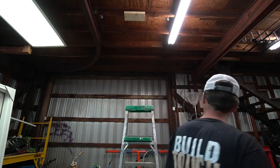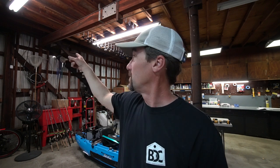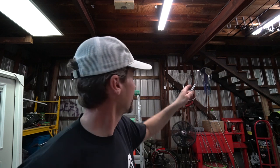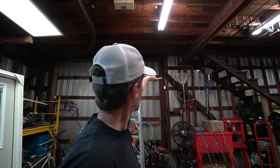This gang reel pulley has to be mounted in the center between the two front mounting points, and it needs to drop down an inch and a half according to the directions, so I cut a block of wood to add up there. One difference is they want you to pre-drill the holes for the lag bolts with a 5/32nds bit. Next I need to prepare the anchor point on the wall where the rope will run to — another eye bolt that threads into the wall.